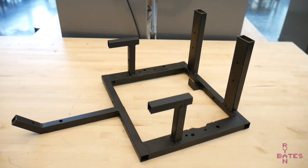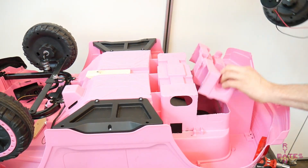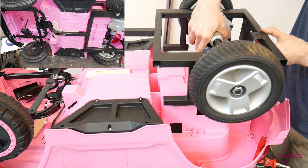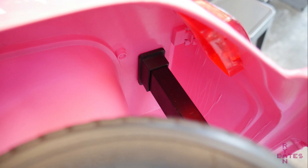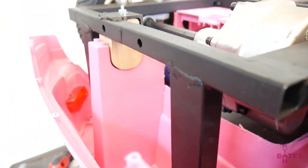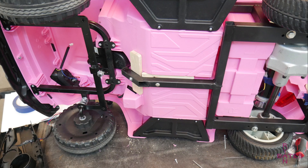With the frame now painted, we can mount the motor and drop everything in. I'm using some wood chunks to fill in some spaces and attach the chassis to the body. These engineered wood chunks also spread out the clamping force of the bolts. I made some 3D printed feet to interface with the plastic body at the ends of the rear metal posts — this spreads the weight out and prevents the metal from poking through, and transfers force to the tires at steep inclines or high acceleration. There's also a weirdly shaped section at the rear of the body I tied the metal chassis into using another wood part and a long bolt. Three attachment points total, and the chassis is attached to the body.